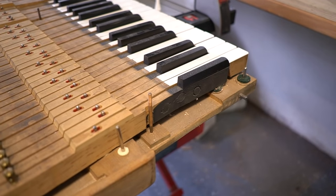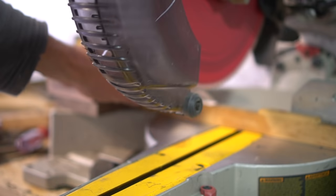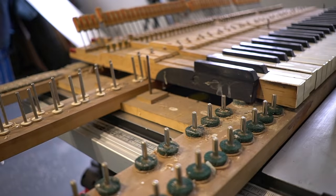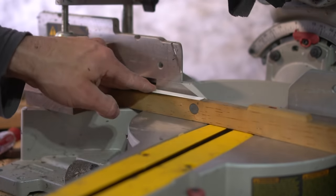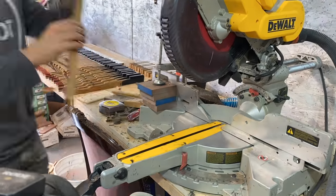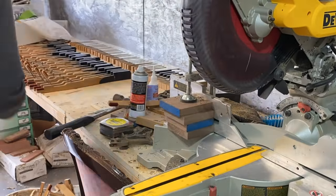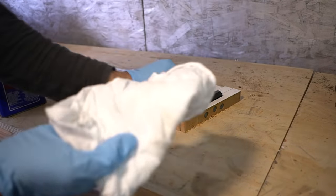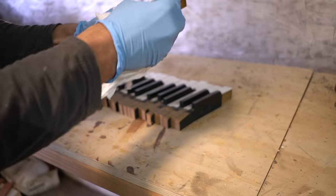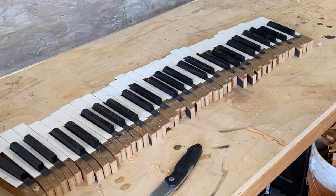For this project, we have a number of piano keys and I can't use all of their length, so I have to cut them all down to size. Each white key I'm cutting down to approximately seven and a half inches. I cut all the white ones first, then the black ones, using a stop block to avoid measuring every cut. I also had to adjust the stop block for the black keys since they needed to be shorter. Once all the keys were cut, I proceeded to cleaning with denatured alcohol — it does a great job removing stains and dries quickly, leaving no residue.